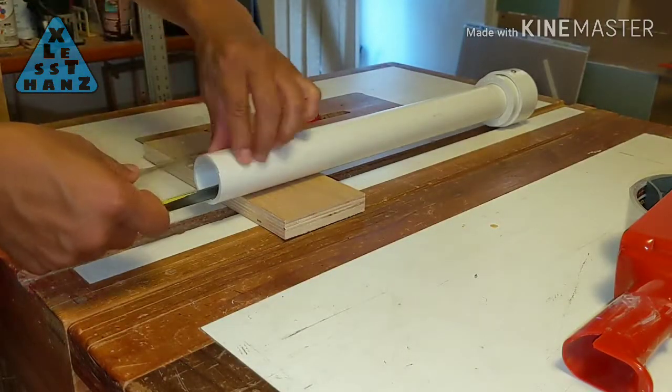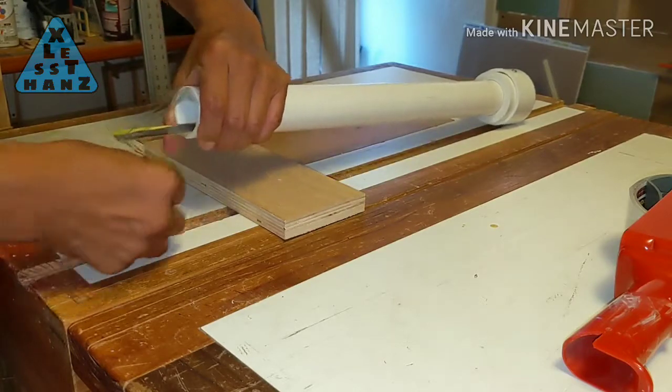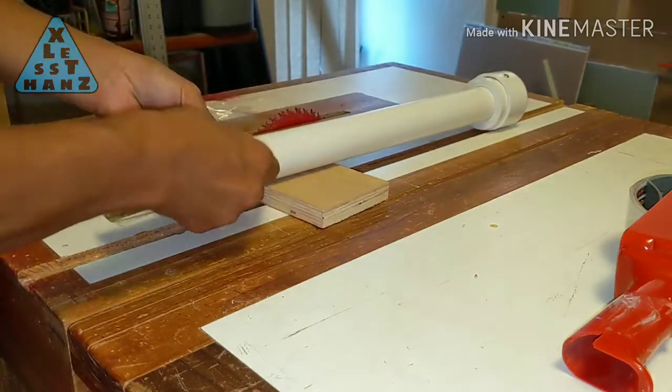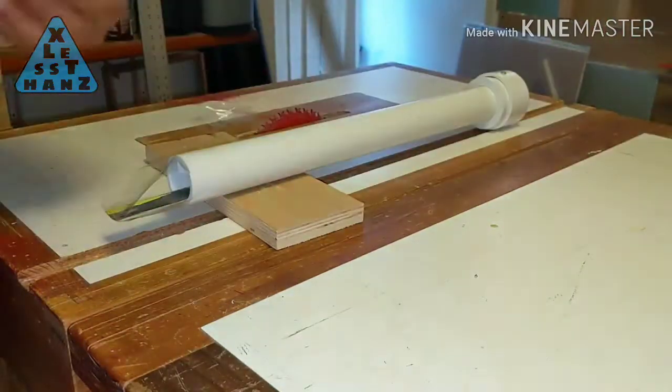To be sure the spring stays pressed against the aluminum bulb housing until the glue dries, use tape to apply pressure to the end of the metal strip sticking out of the PVC. Let the glue dry for 24 hours.